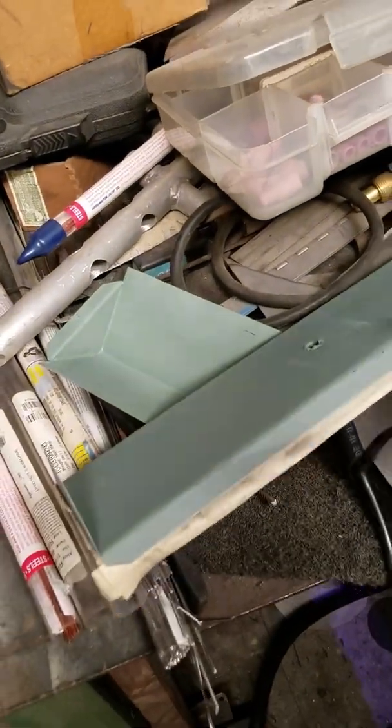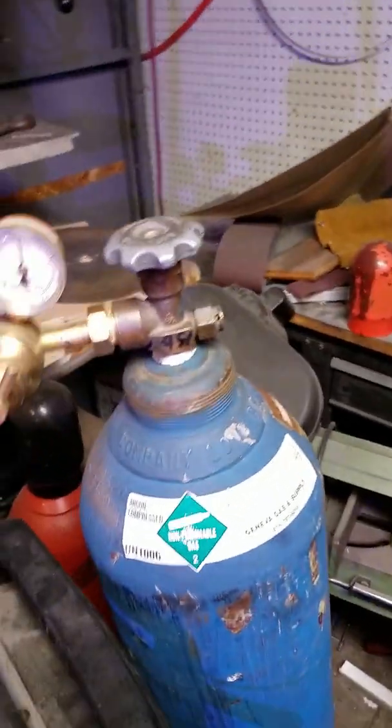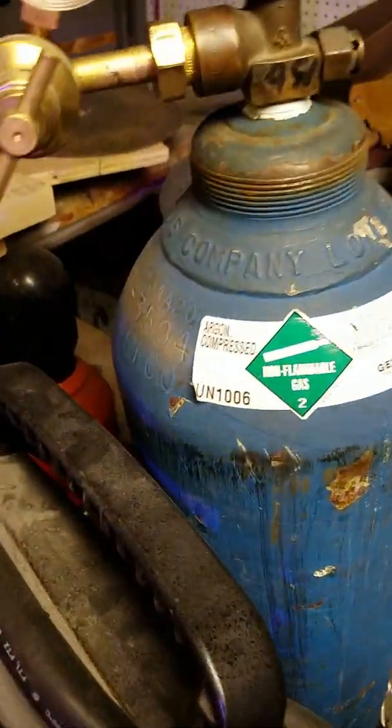You can see the back side of a stainless weld — they're pretty gross. But I was back-purging it; I made a little bracket and when I welded, I put my welding gas — argon — on the back side. I purged it with gas on the back side of the weld so it doesn't look as bad, and then when you do the passivating it brings it back to stainless properties.